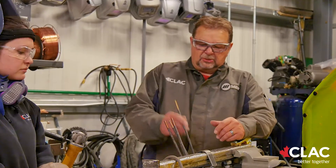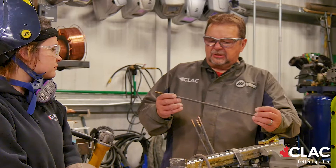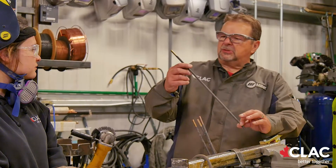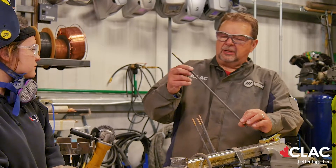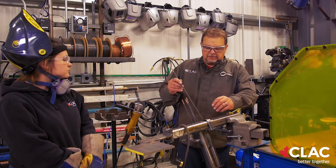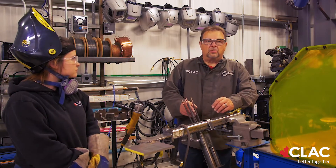The product that's commonly used is Arctech 661T. It's an exothermic welding rod. It's just a steel jacket with some flux on it, and inside it is all the chromium carbide, tungsten carbide, and everything that gives it the wear resistance.